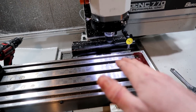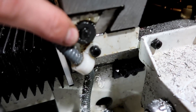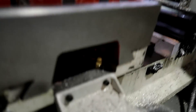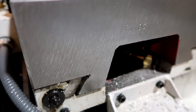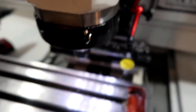I was trying to figure out why this thing was getting unlevel as we brought the whole bed forward. I figured it could be the gibs. That bolt right there — this is actually the bolt that keeps this whole wedged piece in there. There's one on the other side as well, and it actually tightens it, bringing that tapered piece a little bit closer to the dovetail of the bed. I'm no expert on this, I'm just trying to figure it out as I go. So I've tightened that up on the x-axis and then tightened the one on the y-axis. So that's what tightens it down, and tightening those down a little bit seemed to be a little bit better.